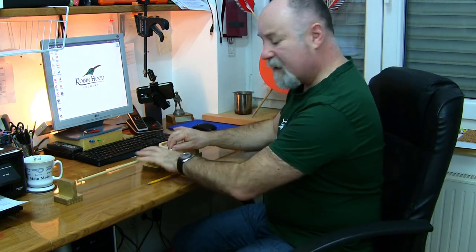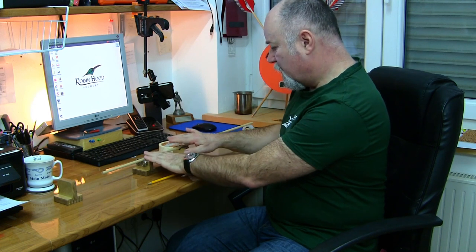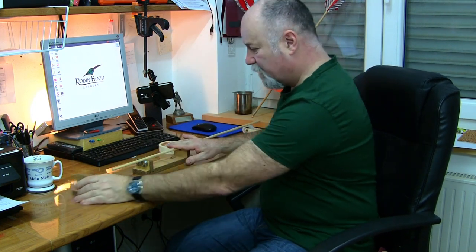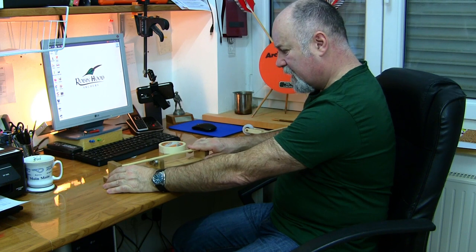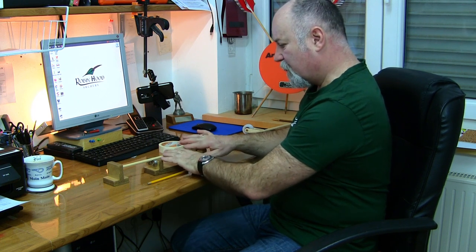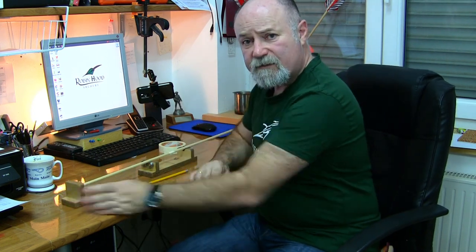You can localize any bends by moving the shaft up or down the spinner and checking locally — towards the left-hand side of the shaft or spinning it around and bringing it right in. You've got quite a short distance between the end of the spinner and the Telltale and you can do the same thing there. That's when it starts to get a little bit trickier, but it's not a difficult task — it's well within the means of the vast majority of people. As long as you're sensible about it, ease your way into it with a few test rolls, and you can actually get really, really good results.